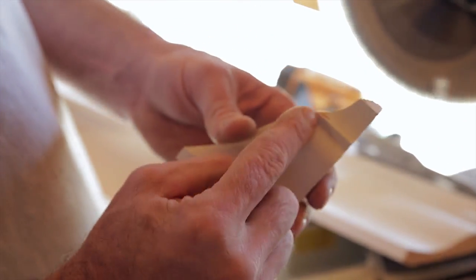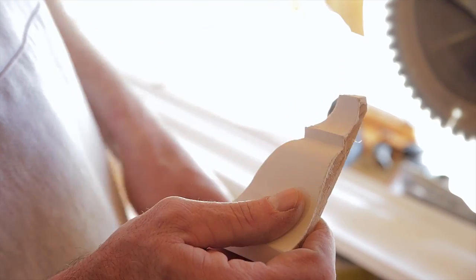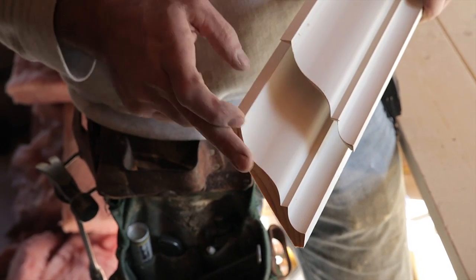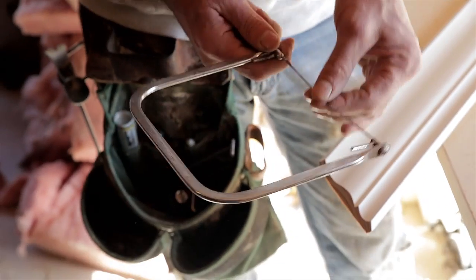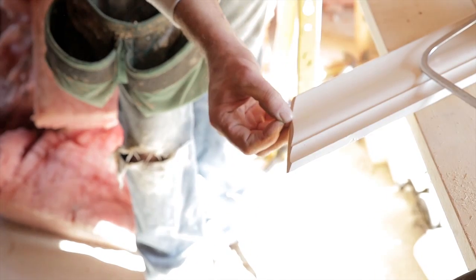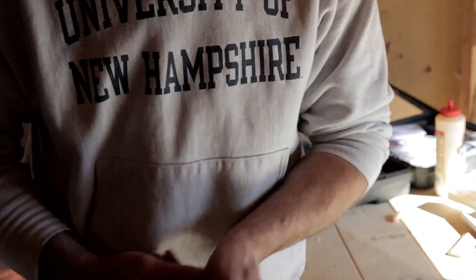Always start with a sharp blade — for this video we have a dull blade, so start with a very sharp new blade. I've just cut this in preparation for coping — cutting out this profile to match the finished product. This is a coping saw with a very flexible blade, and I'm going to back-cut this profile all along this edge to come up with a face that perfectly matches the piece already on the wall.